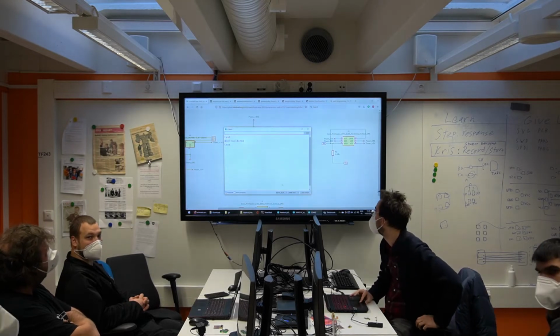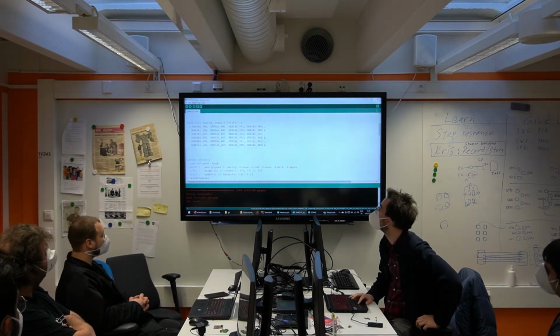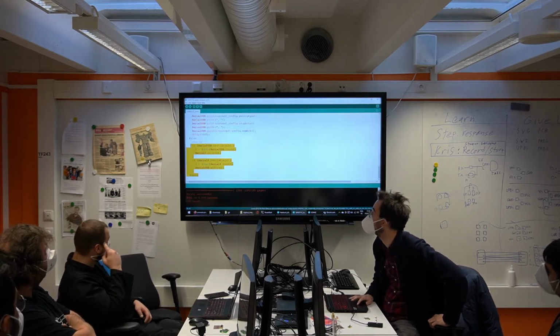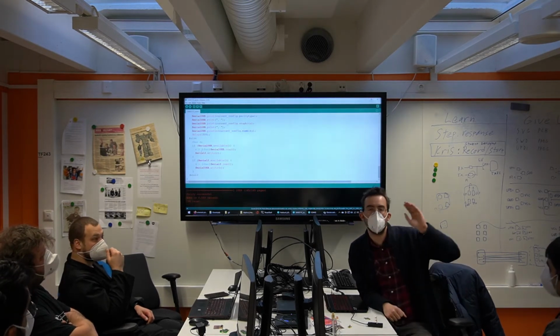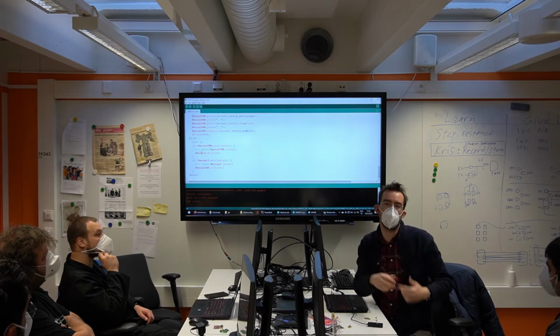So the program that you just uploaded, it's sort of a hello echo thing. It's a hello echo, but that does dynamic baud rate change. That's really all it does. But the echo part is indeed just here. It's not an echo though. It's not an echo. It's a USB to hardware serial. And because we connected TX and RX together, it acts as an echo. Yeah.